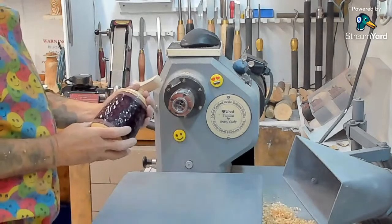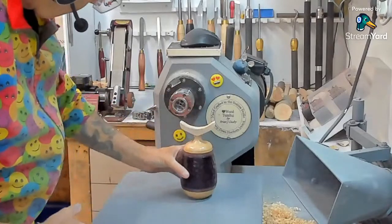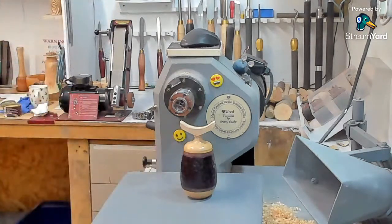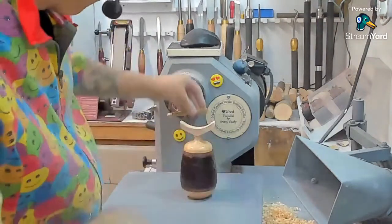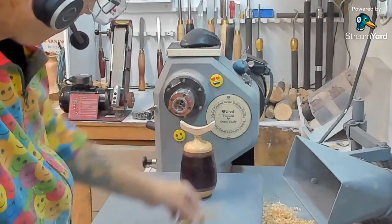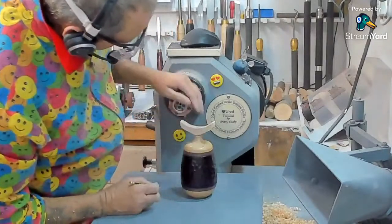Yeah. I think you need to go down to a quarter of an inch on that cove to where the fillet is. That's a grain orientation as well. And down here to a quarter of an inch. Yep, down to a quarter of an inch. And then the dish needs to be a quarter of an inch thick. That's right. And the top and bottom curve need to match. Edges need to be kept square. Aye, this end needs to be square here. Yeah. If you kept them square, you could even then possibly cut it across there, make it square that way. Yeah.